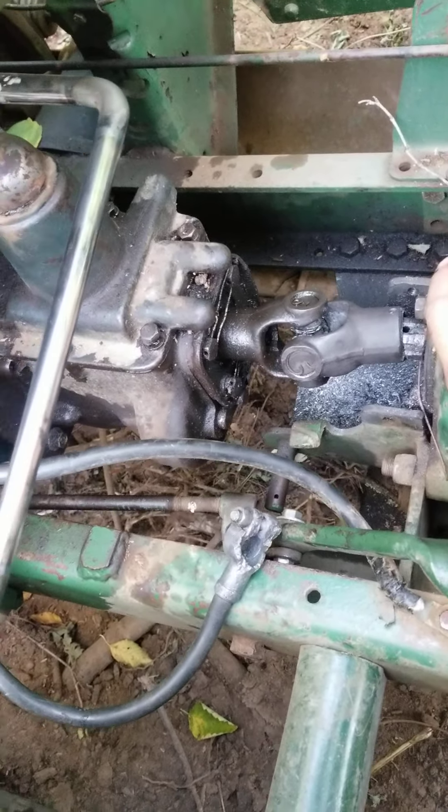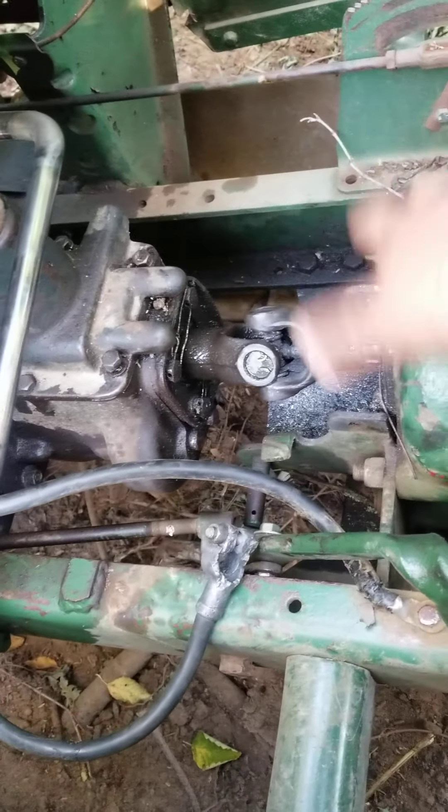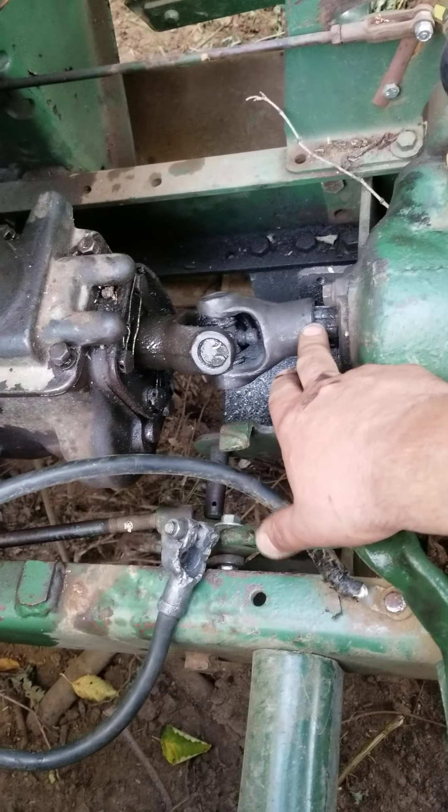The way Cletrac and Oliver set it up — at least on this tractor — is the drive shaft was pinned into the input shaft of the gearbox. Some people cut them down, but because of the way this tractor is, I ended up doing it this way. It was the only way I had enough room, but the geometry isn't right, and so it put too much load on this. These splines, this shaft — you can't find it anywhere, so you can probably rebuild it, but it's a big job.